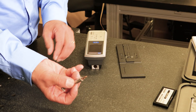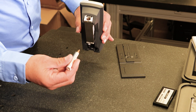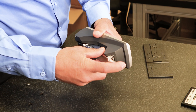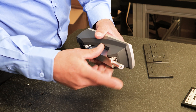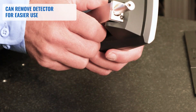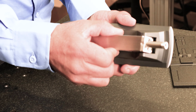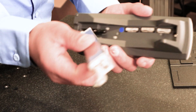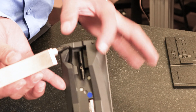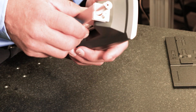To install the stylus, you line up the three pins on the bottom with the holes inside the drive unit, then gently slide it straight in. You should never have to force it. The detector is removable — if you slide it backwards it will pop out. It's held in place by a spring and is also attached with a cable. If needed, there's an extension cable that comes with the kit.